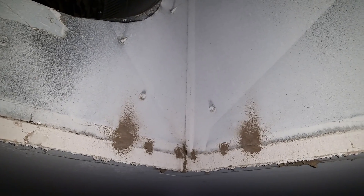Same thing with supply grills. So if you ever have customers that are dealing with dust issues, or units getting dirty but the filters aren't that dirty, this could be your culprit. Make sure you're paying attention to the supply and return grills and look out for this kind of stuff. Hope that helps — thanks for watching.